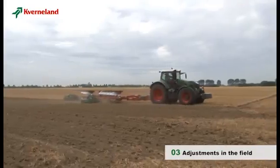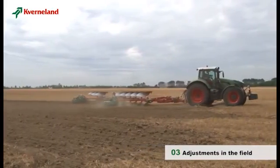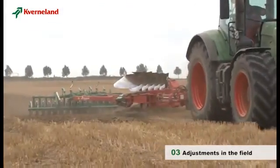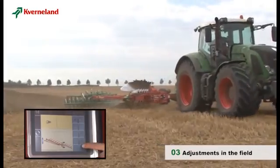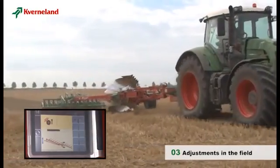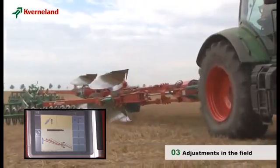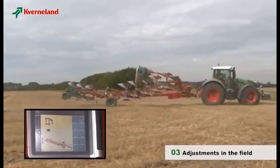The headland operation is controlled by the ATS system. All you have to do is to raise the lower link arms of the tractor and then push 3 times on the ATS start button. The first push lifts the wagon wheels, retracts the top link, turns the front part of the plough to half-turn position, and finally turns the rear part fully over.